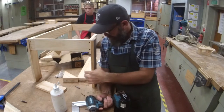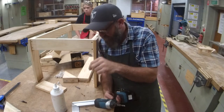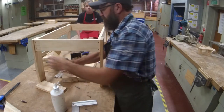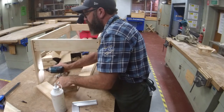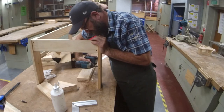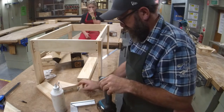My next hot tip is, you know how we countersunk the legs? I want you to countersink through the backs as well. It opens up the hole just a little bit further and it makes it easier for us, because we kind of have to find those holes blind, and it's easier to do. Pretty much the same as what you did on the drill press. I should maybe have mentioned it at the drill press. We could have done it over there easy. So next one.